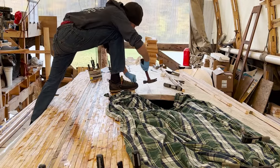And basically the fairing compound on the other side creates a dam in any of the gaps or voids. And we're gonna fill them from the other side now. And then we'll put fairing compound later. But this way we make sure that any knot, any place there's not enough glue in a joint, this should just flow down in there. And we're doing it this way because this will soak right down and fill up any void where the fairing compound or the thickened epoxy won't flow like this stuff will. And we want to make sure that we fill up any voids.